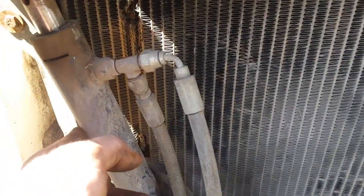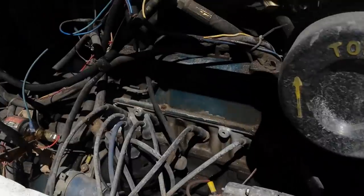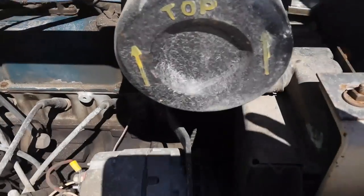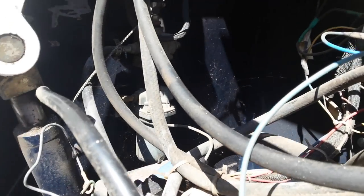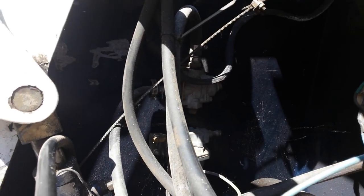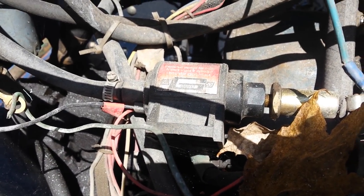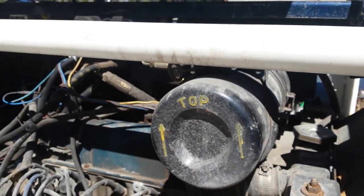It's carbureted — 1.1 liter Nissan motor. The carburetor is terrible; if I could find a new one I'd put it on. This is a high dump: these cylinders lift the box right up and it can dump into a container about four and a half to five feet high, or into a truck box. There's a four-cylinder liquid-cooled gas motor with a little GM AC Delco alternator. We put an electric fuel pump on it — it originally had a mechanical pump. There's what I think is some sort of pressure regulator, and there's the pump right there. You just turn the switch on and the pump runs, then we fire it up. It starts really good.